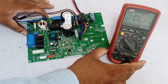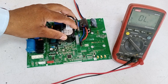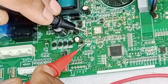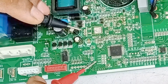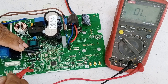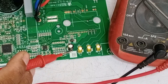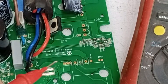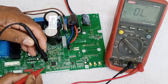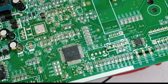I have now made my final decision after testing this circuit board further — the microcontroller is short-circuited. Capacitors E86, 105, 89, 29, and 18 were removed from the circuit. When I put the probes on the capacitor traces, the multimeter beeps. The capacitors themselves tested fine, and the transistors around the IGBT driver circuit were also fine. However, the positive and negative traces of these four capacitors are shorted, which confirms the microcontroller has been short-circuited. This circuit cannot be repaired.